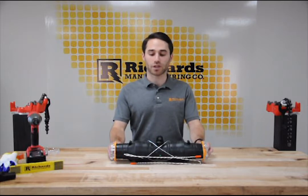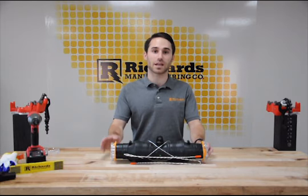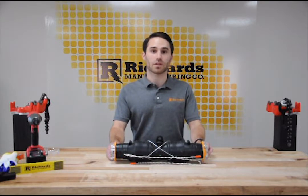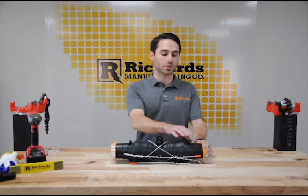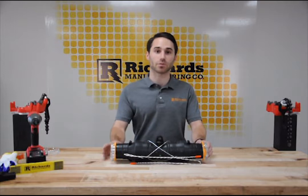The splice is molded with a semi-conductive outer jacket which provides outstanding mechanical impact and tear resistance. It can be ordered with a capacitive test point, which provides system operators with a unique option. Each end of the splice features an integral jacket seal and is expanded with a short, easy-to-remove holdout cord.